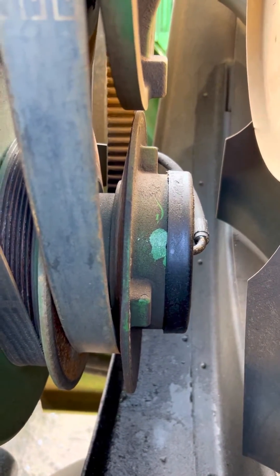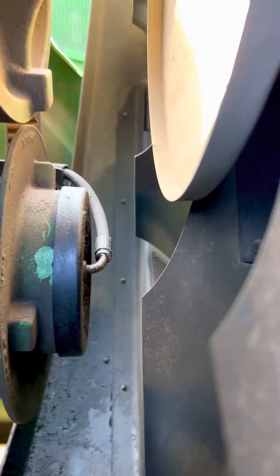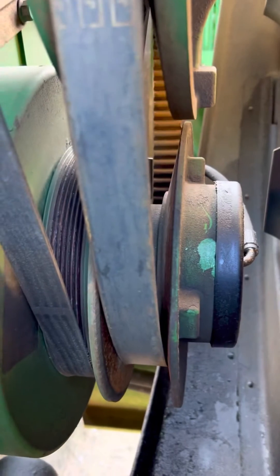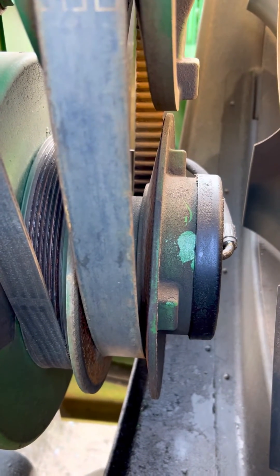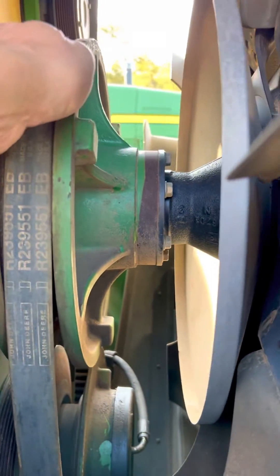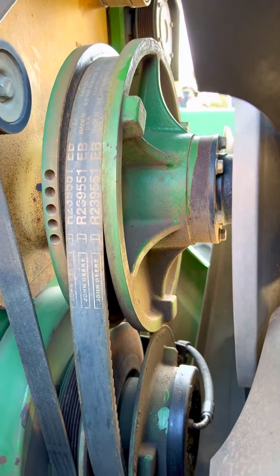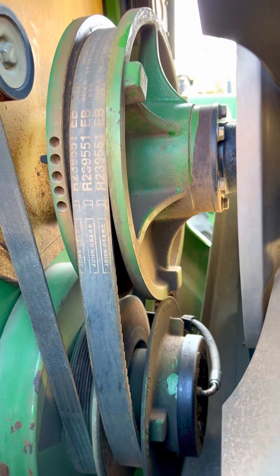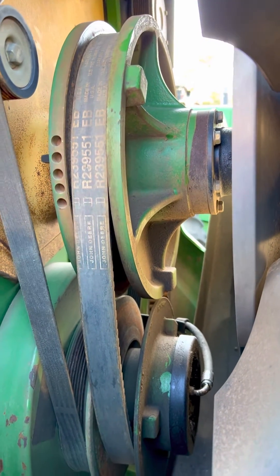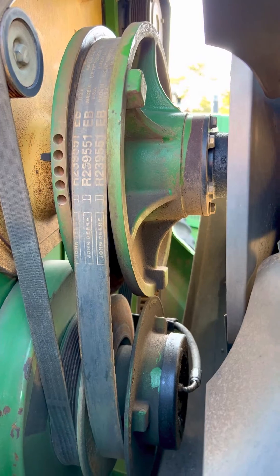Same thing on the driver — we remove the hose and pull it off the crankshaft, so what comes off is what you get. There's a way to test those both on the machine and off: just make sure there's no play in the shafts. And that's about it for the 90-30 series.